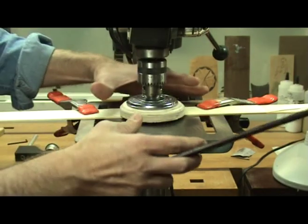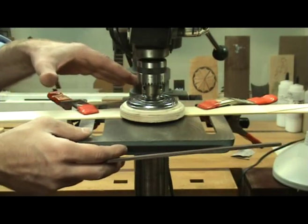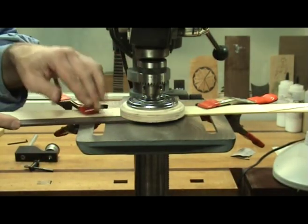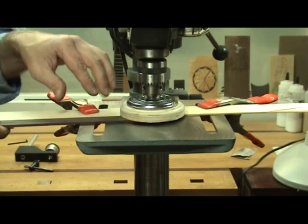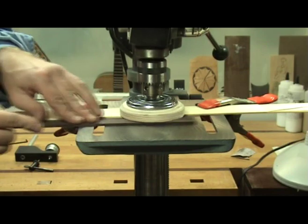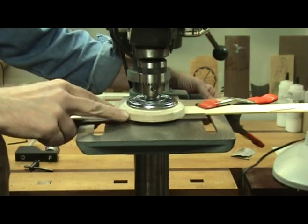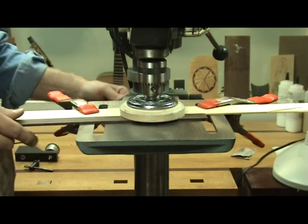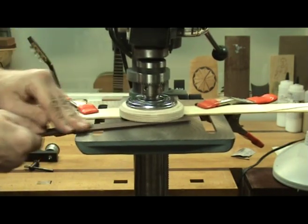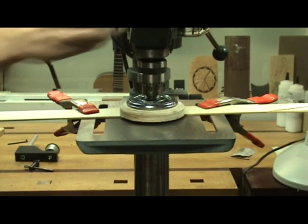If you want to get more elaborate and build a table with an adjustable fence, there are a lot of options — get creative. When you feed your stock into the tool, don't take a big pass and don't heat it up. This is primarily a finished sander, though you can also thickness with it — just don't take big cuts. I usually raise the table until it just barely touches, and when I lock it in place it rises just a little bit more, which is about right. Let's turn it on and go to work.